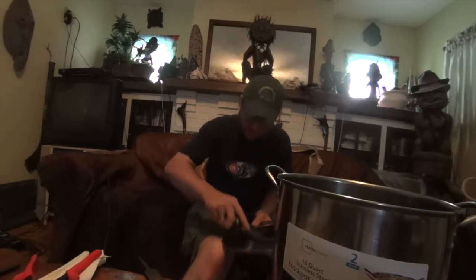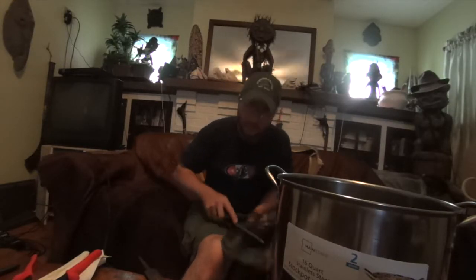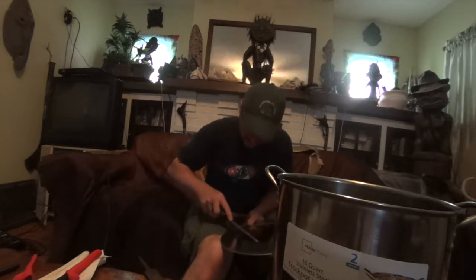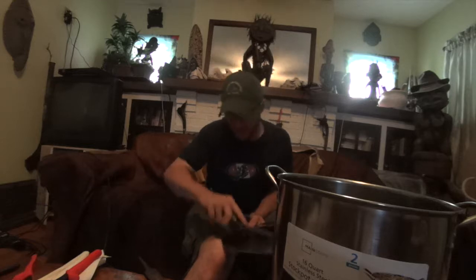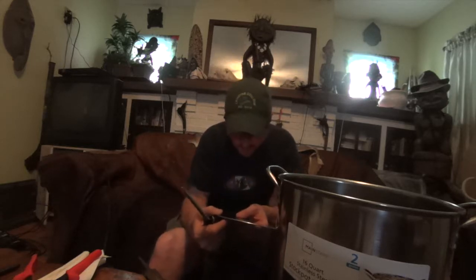Alright, and we're going to go to the other side, and go the opposite direction, and then I'm going to run this file around the face of it. I may even take a stone, an axe stone, and just kind of hit that and deburr that whole thing. This is the same thing you'd be doing if you were sharpening a knife, an axe, a tool.